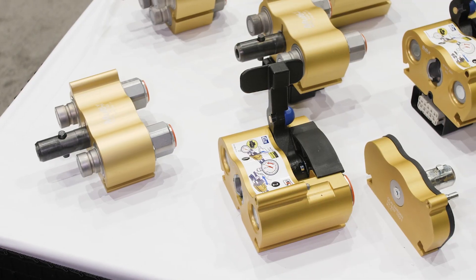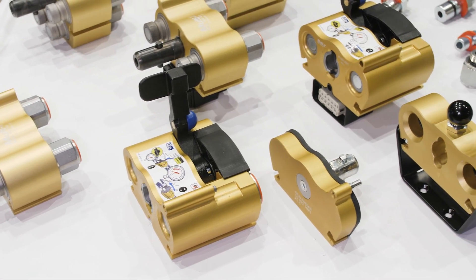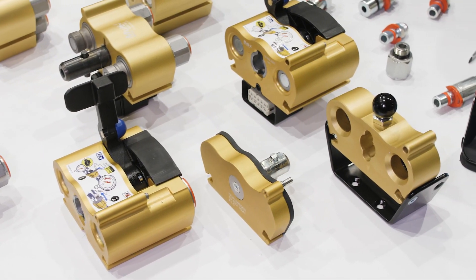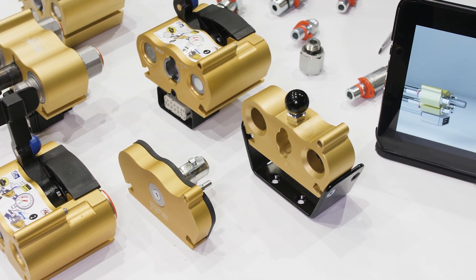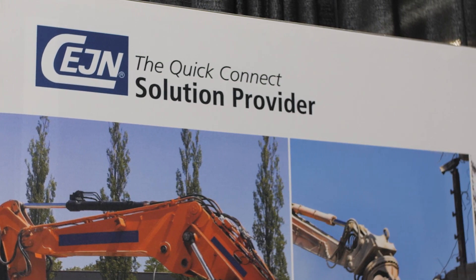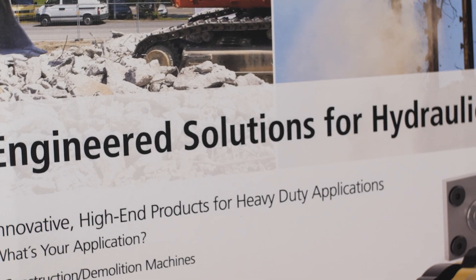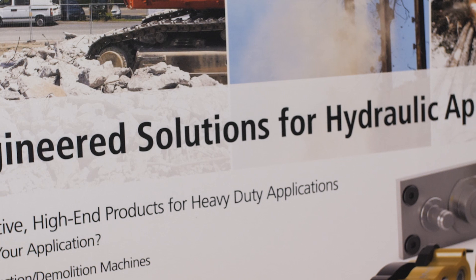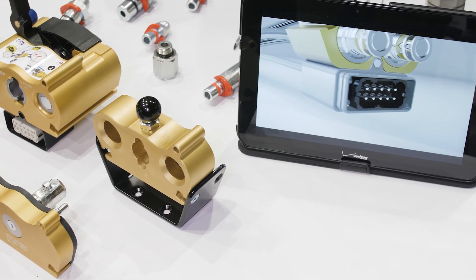One last thing I'll share. On quick connects, it's always an issue when there's stuck residual pressure on the attachment side. We've all seen it — they take a hammer with a screwdriver to try to pop a valve open or they're cracking the line open. Unfortunately, it's putting contamination in the system. So the whole idea with the male half on the attachment is there is a secondary nipple opening which bleeds off residual pressure up to full working pressure. We no longer have to fight and deal with that anymore.